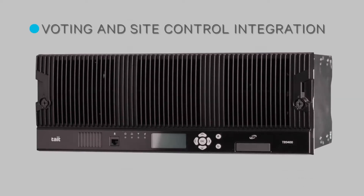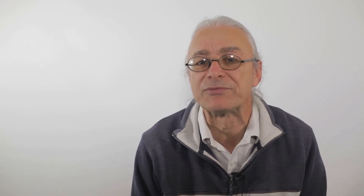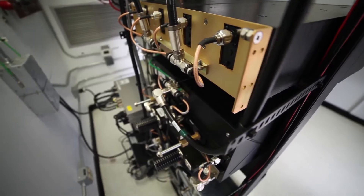One of the early decisions we made on the engineering team was to integrate the voting and site control into the TB9400 base station. We removed the need for a third party voter, simplifying the initial setup by reducing the equipment required for a typical analog simulcast network. It has saved significant rack space and power consumption and led to greater system reliability through having fewer points of failure.